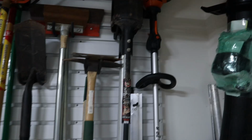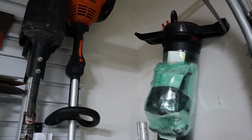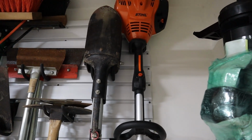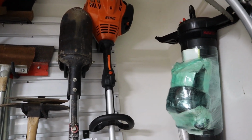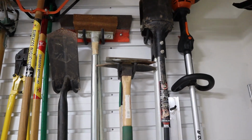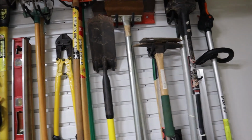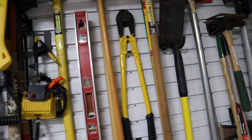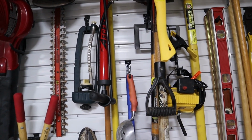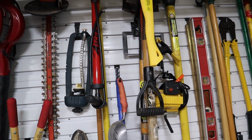The other thing I did was found the studs. So the first stud off the wall was here. Now in this particular framing, it's every 16 inches. And so I run a tape measure over about 16 inches and then start with my stud finder and find the studs. And every 16 inches I hit a stud until I came here and I had a set of studs in between there, and I took advantage of them.